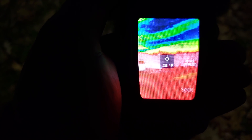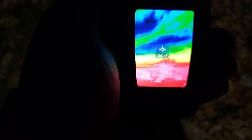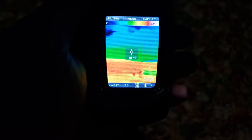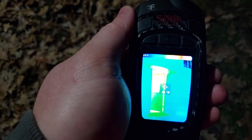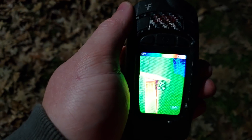There's the road and my neighbor's house. Clouds have different radiation qualities than surfaces. In full frame mode it gives me a minimum and maximum on screen — negative 9 for the clouds. The house and cars are approximately 45 degrees Fahrenheit. With the door open, the maximum is 66 degrees near the top. The sky reads negative, but the ground reads about 27. The temperature readings on this camera are not calibrated, so I can't fully trust the actual values.